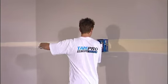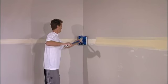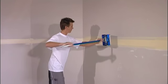When the setting is correct, run the flat box along the joint, applying the brake and sweeping the box away from the wall 300mm from the end. Using the same technique, turn around and coat the remaining 300mm.